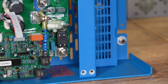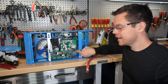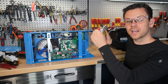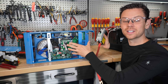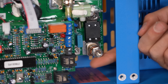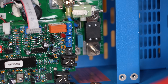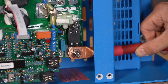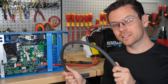Notice that this inverter has a fuse — most DC devices have their own internal fuse. That fuse is for the device itself; the fuse we're installing only protects the wire that supplies the inverter, not the inverter itself. For the positive battery connection, remove the nut and washers, add the positive battery cable, then add the washers and nut back. Follow the same protocol from the inverter back to the battery.